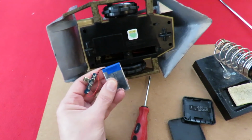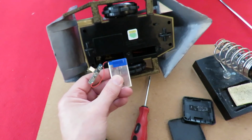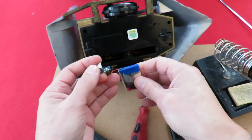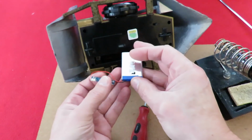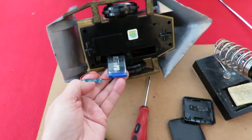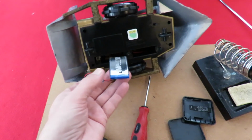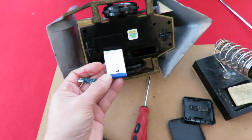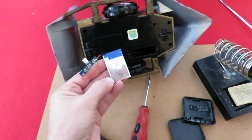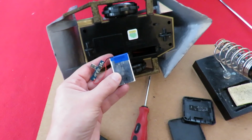2S. Now, just to make people really pleased, I've no intention of putting a battery management circuit on it at all. So it will be liable to overcharge and over-discharge. I'll rely on my charger to make sure that we only charge it at the right rate. As for discharge, I'm just going to have to keep an eye on it.